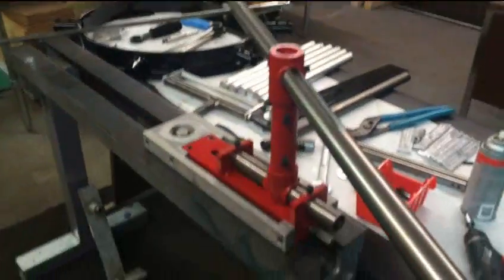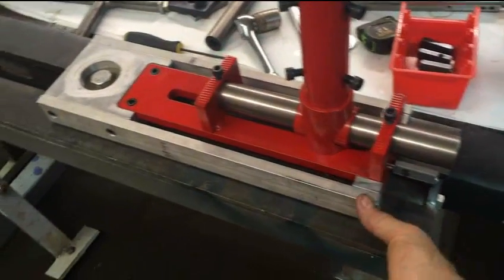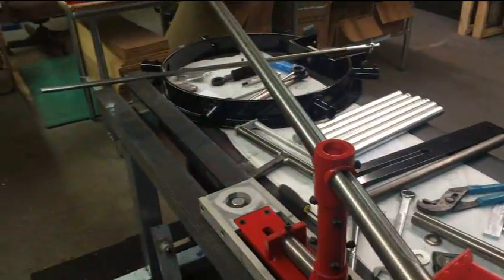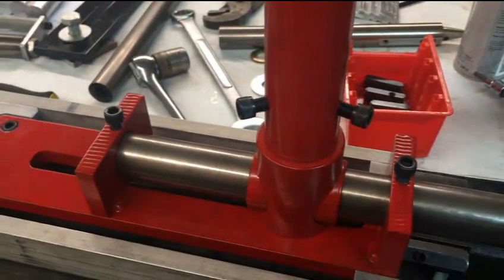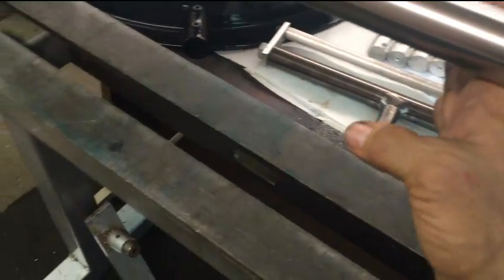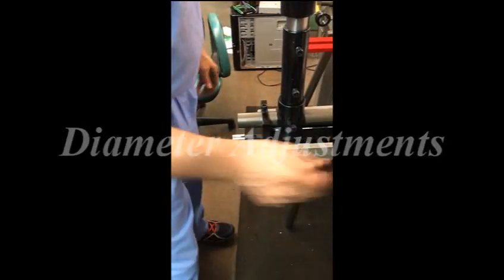For concave turning, we have a long hollowing bar. Put the base of the sphere-turning jig parallel to the ways — it's potentially better to place a clamp on the backside. You don't have to remove the bearings since the whole thing rotates; we just rotate it over onto the ways and stabilize it if necessary. We can then rotate the bar to do a large diameter, because the bottom three set screws are loosened to allow the bar to rotate. There is some play, so it may be necessary to place a tool rest in front of the bar to stabilize it.